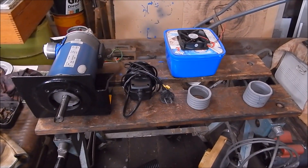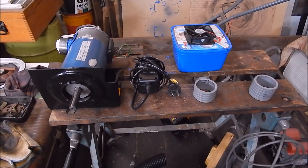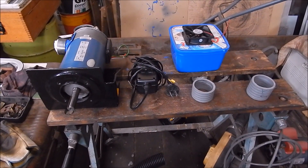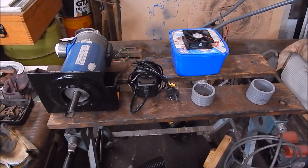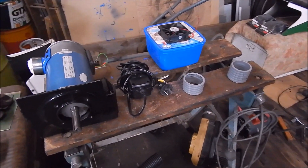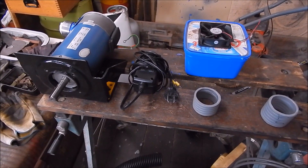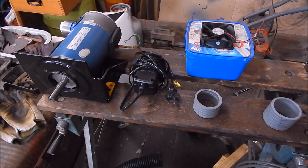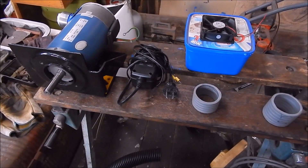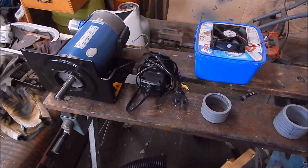The air ports out through the front of the motor. Here's the power supply I'm going to use for the air blower - it's the Canon BJ power pack from a Canon BJ printer. It puts out higher than 12 volts; I'll be using computer fans again. The power pack puts out 17 or 18 volts so I'm actually going to overdrive these computer fans, which makes quite a big difference. With them running the measured voltage is 15 volts, so I think they'll stand up to it.